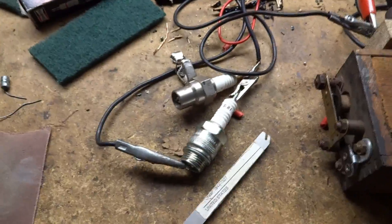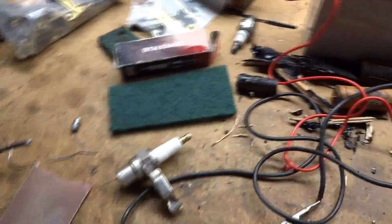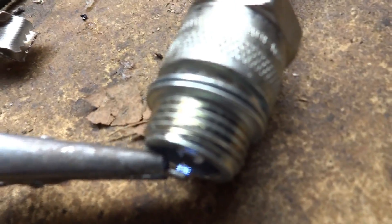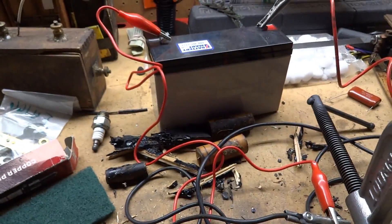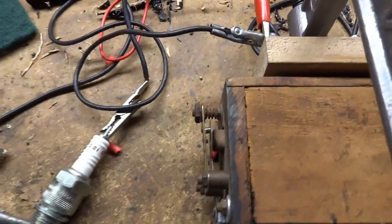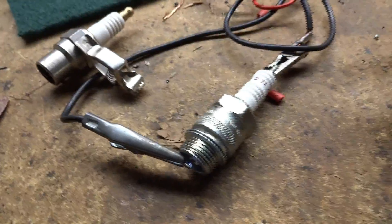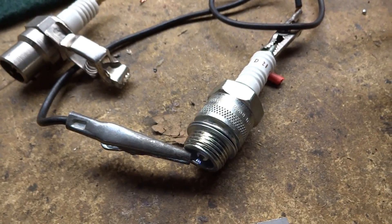So I put the D21 back in line — the test plug's out of the way. You can see the great spark that we're getting now off of this coil with the D21. Again, this is only 6 volts, just hooked up with some clip leads and a homemade jig to be able to run this kind of coil. I personally don't like these button-type coils for stationary service. For the work that we do, I'm really convinced that the thumb screws are the best way to go.